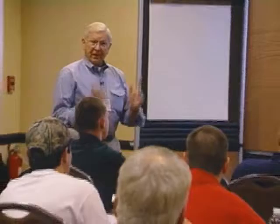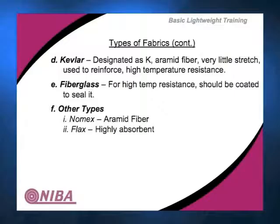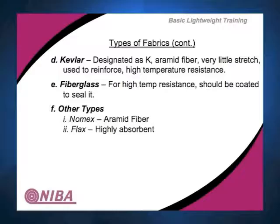So there we have three basic fibers in the first slide. Moving on to Kevlar — Kevlar is an aramid. We know about it from applications like bulletproof vests, where it has fairly high strength. It has very low stretch, and another characteristic is that it tends to be a little bit on the brittle side, so it does not really like shock loads.